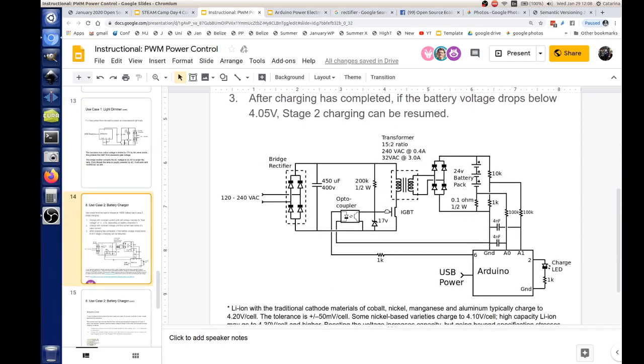So, what were you saying? We were talking about the voltage and the current going through. How do you measure current and how do you measure voltage in a system? The current. Yeah, and this is just tied to ground right here. The 100K resistor is just enough to give us a good steady voltage measurement.